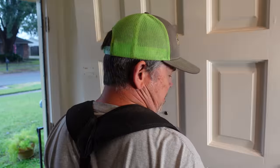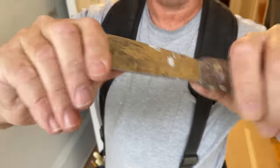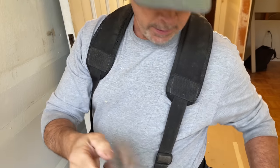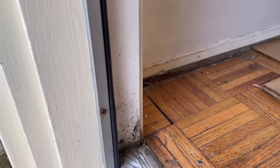Never throw those on white carpet. Now our next step, we're going to remove the interior casing and our threshold. I'm ready to remove this casing. What I use is a stiff bladed putty knife — look at that thing, it hardly bends at all, and it's got a chisel edge. I carry this in my bag and use it for everything. I'll just start right here and pry it off. It works great.